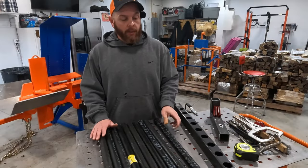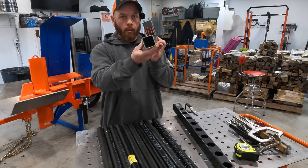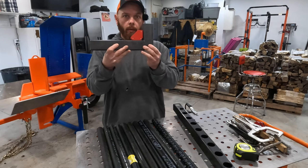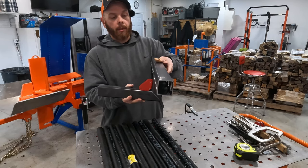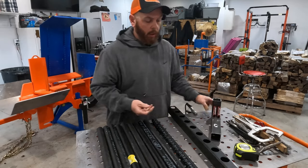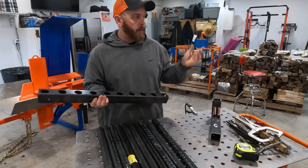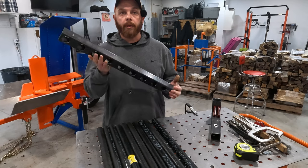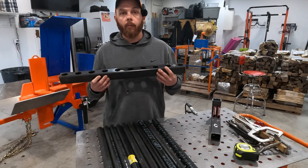The grinder did a pretty good job — I was able to cut all the pipe down and also cut the square tubing. I'm using two-inch square tubing, eighth-inch wall, and I was able to cut a pretty good angle on there. This is going to go into where the hitch goes on the front of the splitter and it'll be pinned in place, with all the bars sticking out. I was a little nervous about putting the holes in here — I just used a hole saw in my drill press on the bench — but I'm pleasantly surprised with how it turned out.